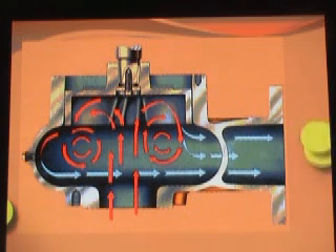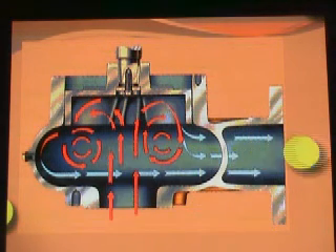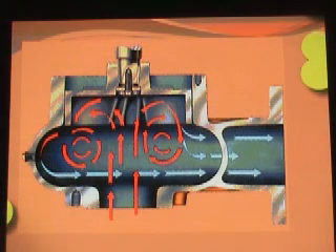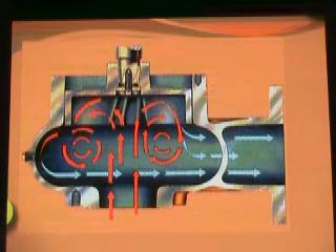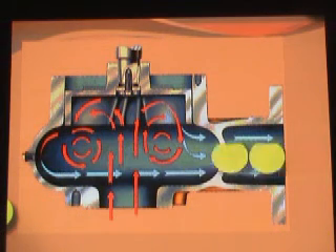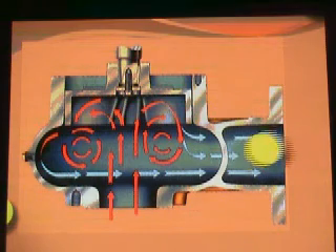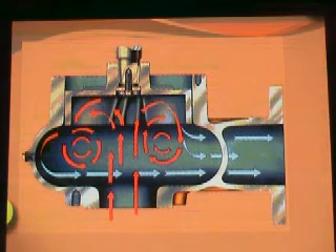Theory of the Vortex Pump: The principles of operation of a 100% recessed impeller vortex pump are simple. The pump spins in an area of the volute that's completely out of the flow path. The spinning creates a vortex similar to that found in a toilet bowl when being flushed. Since the impeller is not in the flow path of the volute, the pump is ideal for handling liquids that contain long stringy solids, large diameter solids, and slurries, or a combination of these without plugging up. Basically, whatever goes into the suction of the pump will be pumped out, as long as the solids are smaller than the discharge diameter.